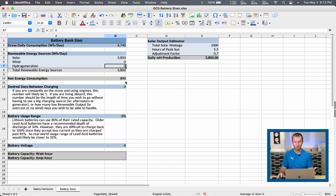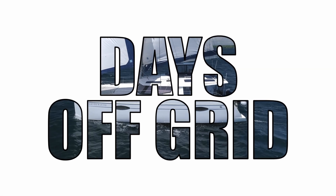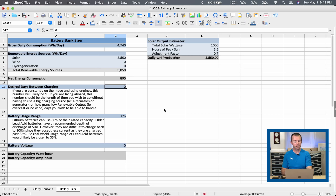We've got a net energy consumption that is positive, meaning we use more power than we generate via all of our renewable energy sources each day, which leads us to the next few questions. How long would you like to be able to go without having to charge your batteries if you are using more power per day than you generate? That's been our energy consumption philosophy since we've been on the boat — the batteries and the solar have been sized so that we can go X number of days before we have to start the generator. Roughly, we go about five days between having to do chargings.